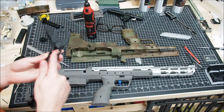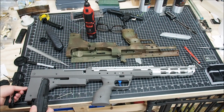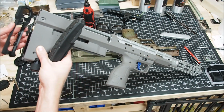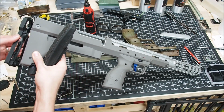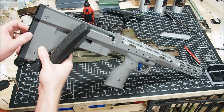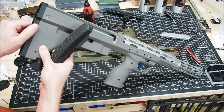So on the first layer, you really need to bevel the edges almost all the way, because we have this curved piece here sticking out, so we need to be able for that to sit around there. And I also had to remove it here enough so that I could come down far enough without hitting the body of the regulator, so it could engage in the locks.